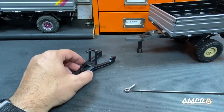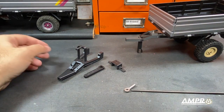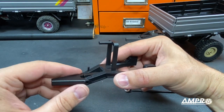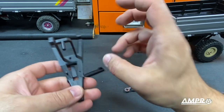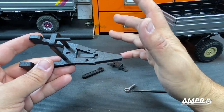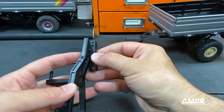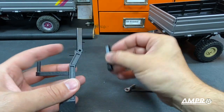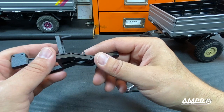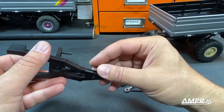Here's the part from Shapeways — that is the main leg, and here is the adapter for the trailer hitch. One minor weird thing: there were four standoffs here for a pad I haven't designed yet, and when it arrived yesterday three of them were broken. I think what happened is Shapeways may have thought these were sprues, because on the bottom it was attached here — this is the exact same shape they recommend for a sprue. So perhaps they thought pieces had broken off. Anyway, a little bit annoying — my own fault though, I made it look too much like a sprue.